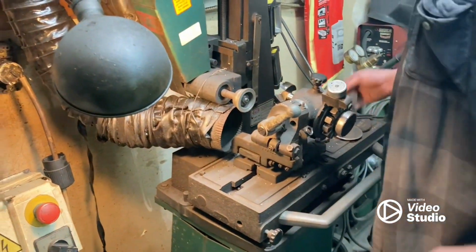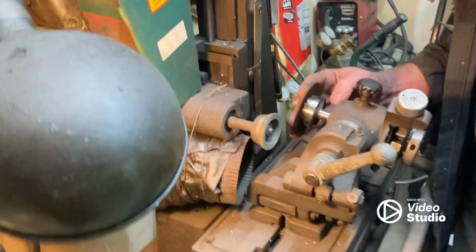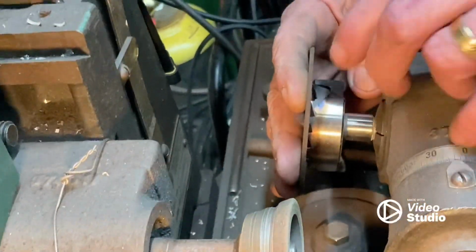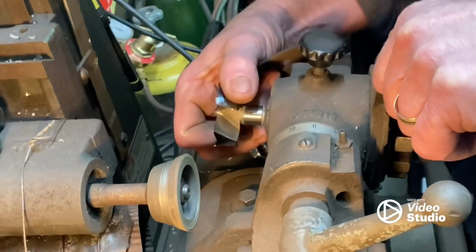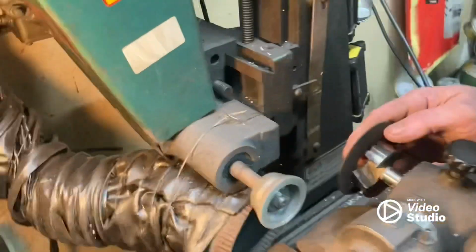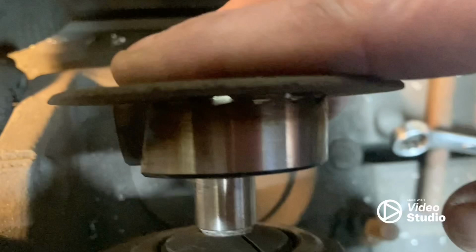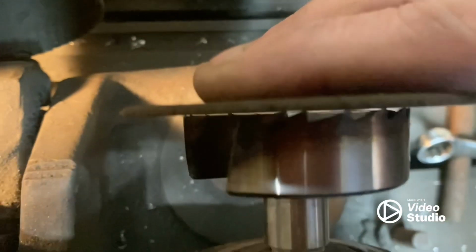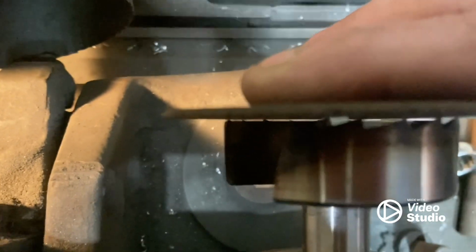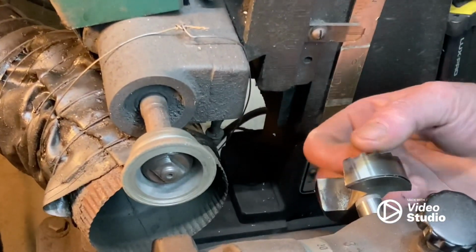That's in the bag. All right, let's get her up here. We need 15 to 20 thousandths on this chip lifter. Let's see if we can get a shot down here. Put a shirt down on it. It's not going to show it up. There you go, I think you can see it. You need 20 thousandths on this chip lifter lower than the cutting teeth.